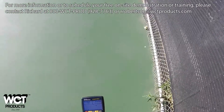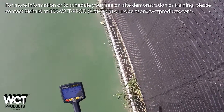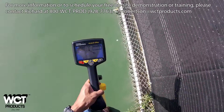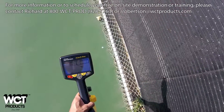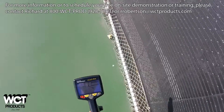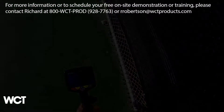This Offset Screen allows me to be on this nice level tennis court and still locate the line. As you can see here, the locator is telling me that the line is 3 feet 10 that way and 2 feet 8 inches deep — still giving me an accurate depth and telling me how far to the right it is of me.